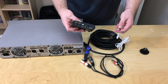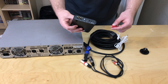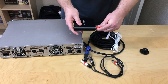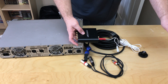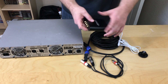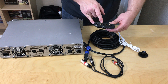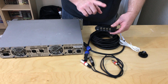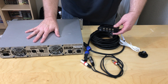So if you're using one LFE output — which is totally fine from your AVR — you can plug this into IN1. That will provide your connectivity from your AVR, from your Marantz, your Denon, or whatever it might be, to your DSP. From your DSP, you then need to output these four outputs, in whichever combination you prefer depending on the number of subwoofers you have, to your amplification — and that's going to be this iNuke 6000.